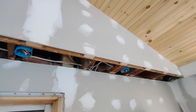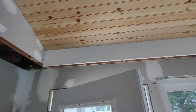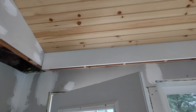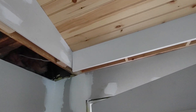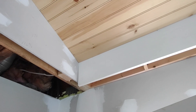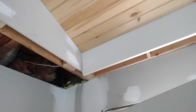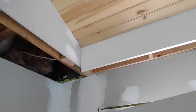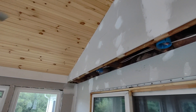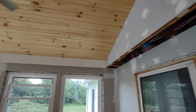I have to hang a fascia board across here to match these. When I bought these fascia boards, all three were the same size — I just wasn't thinking. When I put the beadboard down that rests upon the face of that fascia, it shrinks the height of the fascia, which means I actually have to rip the other piece to the height you see now so that it matches all the way across. I'm hoping to get the columns, fascia, and beadboard in today.